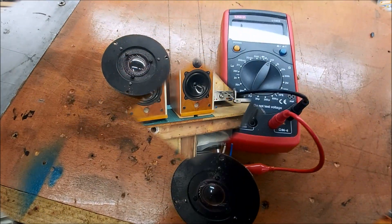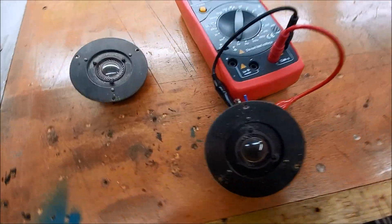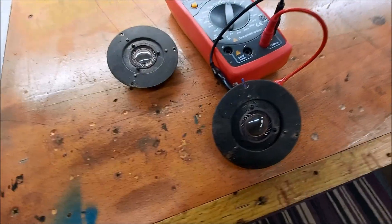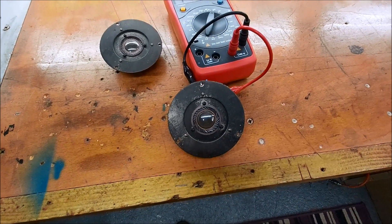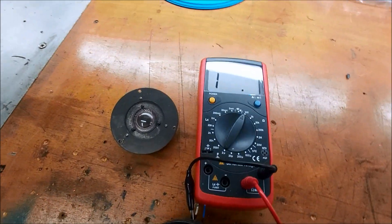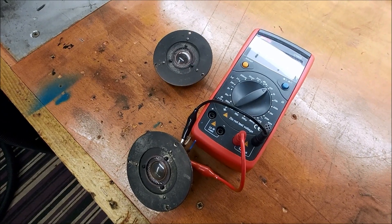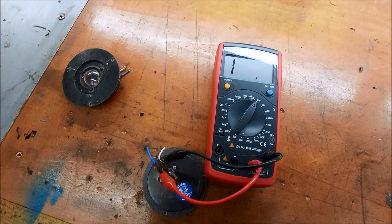The DM4 uses a 16 ohm version of the Coles 4001 super tweeter. There is an 8 ohm version as well, and you can buy these new from Falcon Acoustics — they're a later variant, look a little bit different, but ultimately the same thing. However, both of these are open circuit — completely open circuit — and so is the other one unfortunately.